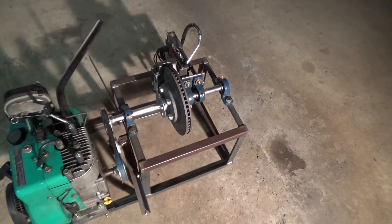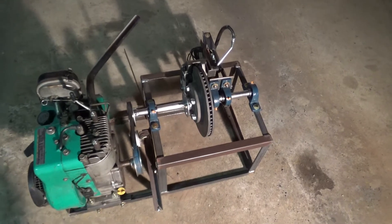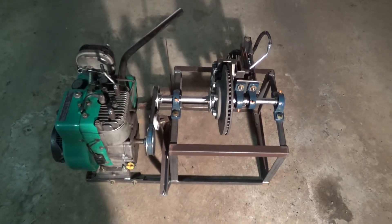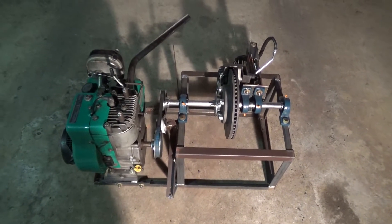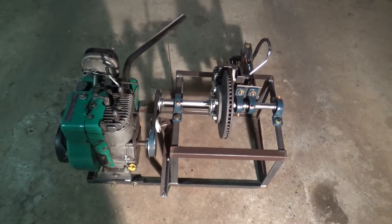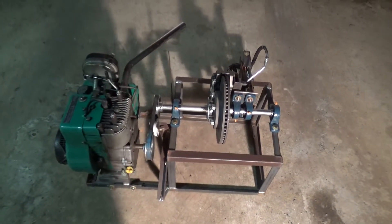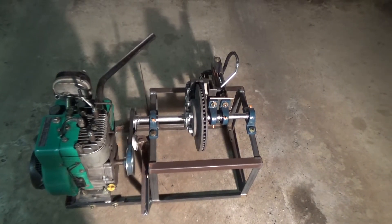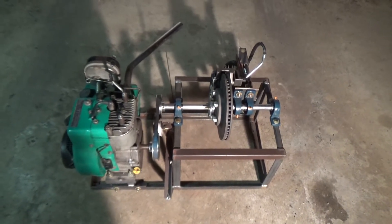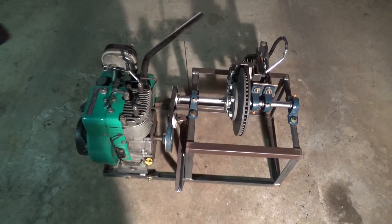The second input — originally when I set this up, I had it set up for shaft drive: Lovejoy coupler direct from the engine to the input shaft on the dyno. When I went to fire the engine up, I found out that the dyno has too much rolling inertia. That 5-horse Kawasaki motor does not have enough power off idle to do that. So I ended up having to figure out that I was going to have to clutch it.